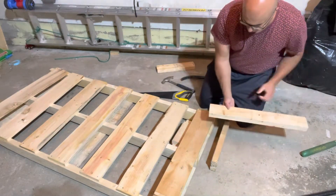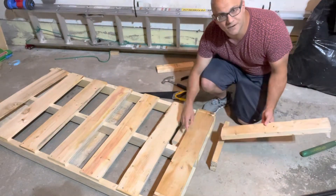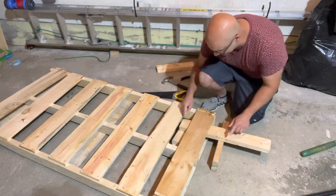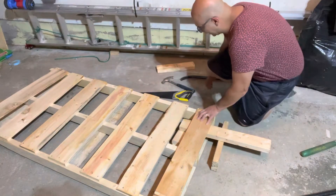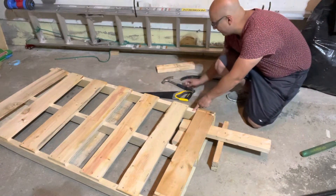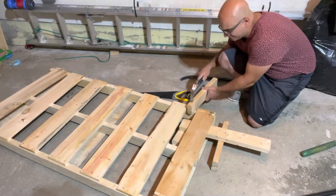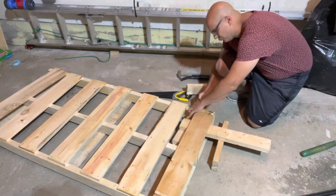Now I'm going to get an additional piece of wood and slide it essentially underneath the board that I want to remove, but on top of the stacked pieces of wood. So I'm going to lift the pallet up and slide this piece underneath that board but on top of the stacked wood. Essentially, this board is underneath this piece of the pallet but it's on top of the wood props. Now I'm going to hit this end — because it's elevated off the ground — a couple of times to loosen this board. I'm giving it a few hits and now it's actually raised up.